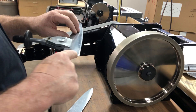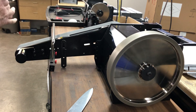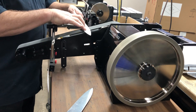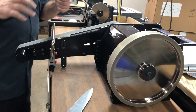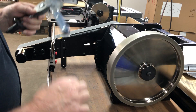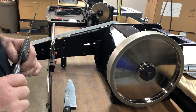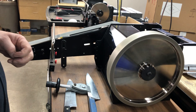In this case it's not unlike being on a grinding stone with a knife at 45 degrees. We also have a leather belt that fits on this, so for those people that really want to do a keen job on the edge, you can just put the leather belt on and hone it out. That's a nice operation — I like it. It's going to be standard on all of our Edge grinders for sharpeners. Thank you for watching, hope you're all healthy, have a nice day.